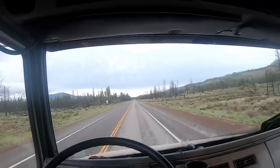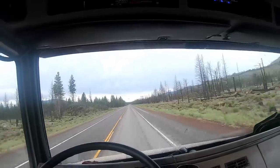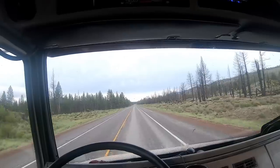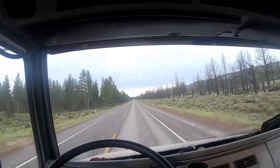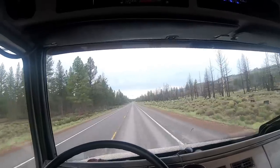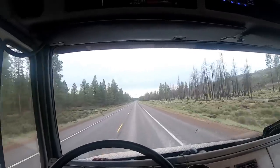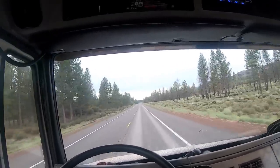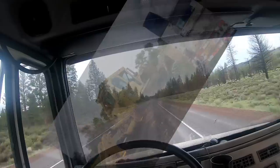Then I've got the oil pump, the D8k. I gotta run by this store in town here and get a little bit of 30 weight powertrain oil to prime the pump. And I got filters for it. I gotta find the suction screen on there too. I'd like to clean that suction screen, make sure it's clean. And then hopefully we'll fire it up and see if she moves. So anyways, I'll be with you when I get down there.